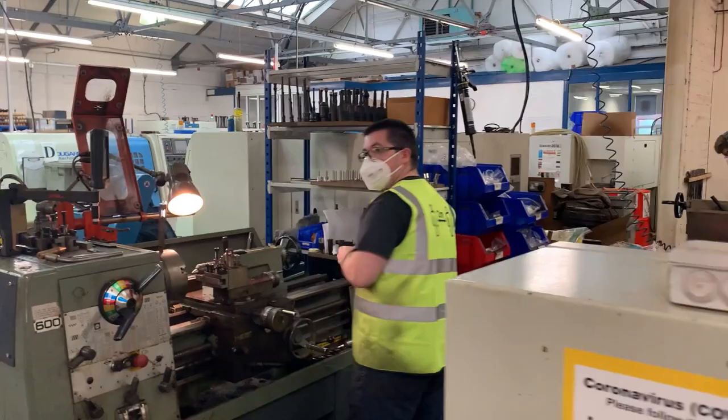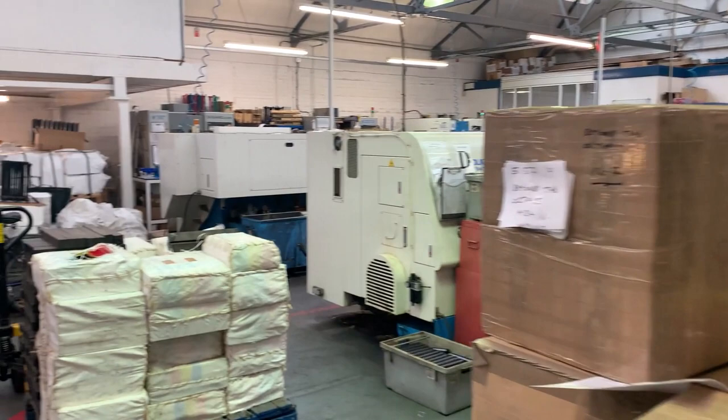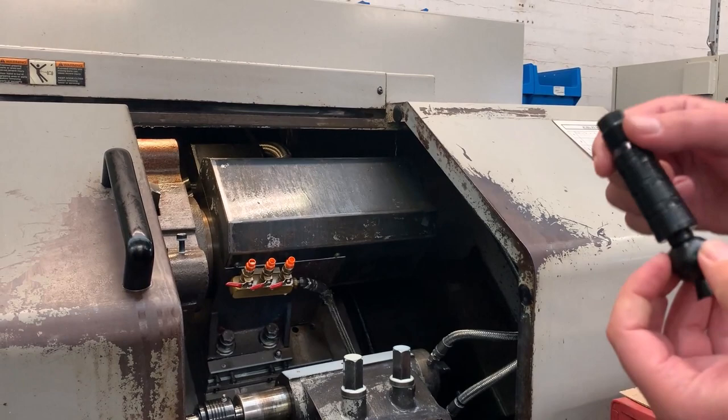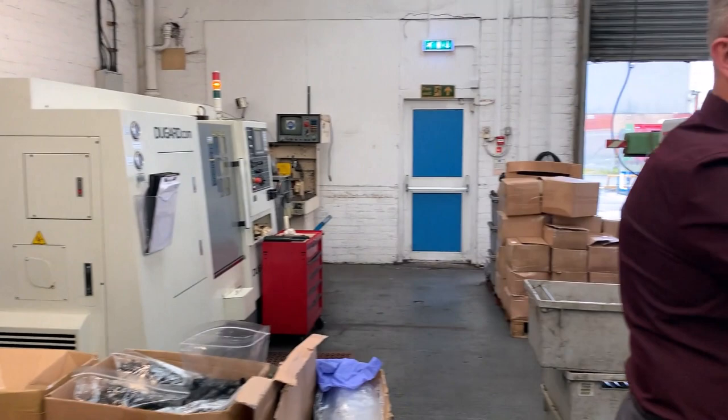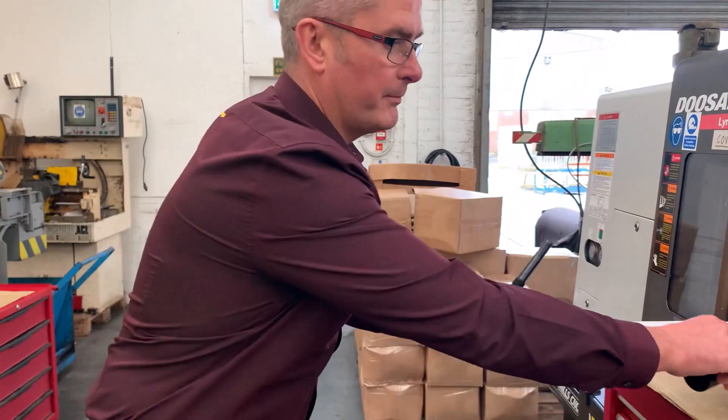We're looking at small pipes and small pipe components. We're looking at various different components. This is part of a universal ball-pipe — ball joint, ball stick. We've got two chanters to be fitted. These are uilleann pipes just at the early stages, first operation — we're just turning and threading, and it will end up as a tenor joint. You can see the imitation ivory mount, it's screwed in place.